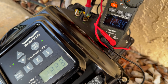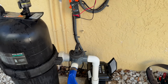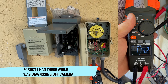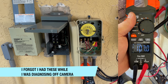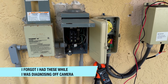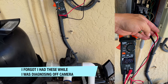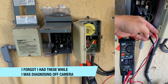Now we're going to keep going backwards to figure out what the problem is and test the timer box. In an effort to save the pump and stop it from turning on and off so quickly from that massive sudden voltage drop, I tested the timer box and sub panel off camera. At the timer box I had the exact same thing — 129 to 130 volts at start, then as soon as the pump started up it drew all the way down to the low 90s, the pump cut off, and tried again. I moved over to the sub panel — exact same thing, 129 to 130 volts at start, draining to the low 90s on startup. So there is no issue from the pump to the timer to the sub panel; the issue lies from the house panel to the sub panel.